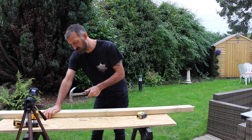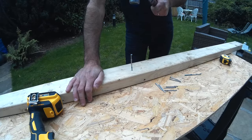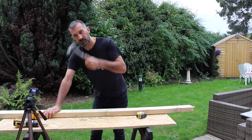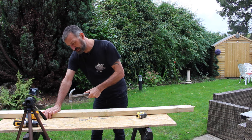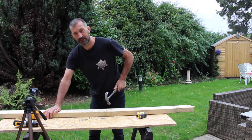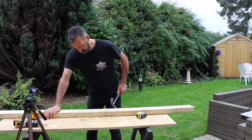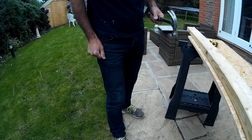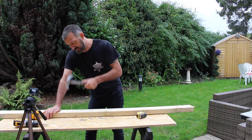Now it's a case of striking down. If you look, it's a vertical hit — a vertical movement. You don't want to be going across because that will bend the nail, or back, that'll bend the nail too. Stand with your feet set, one foot slightly in front of the other, and then hammer down.